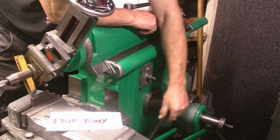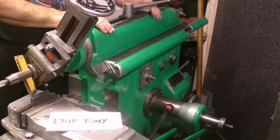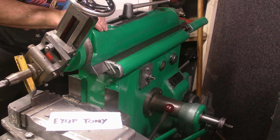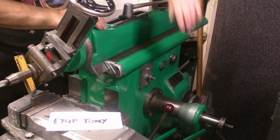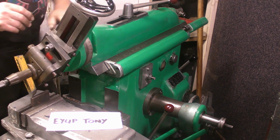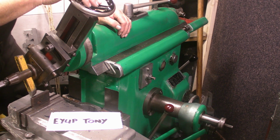Clutch control is this side. This is the screw that adjusts the ram travel, increases and decreases it, with a locking ring on. And then you've got the ratchet mechanism for controlling the table feed one way or the other with this. Manual crank as well on this side. The head is tiltable, it's got 90 degrees either side. And basically the clapper box and the vertical slide. So it's basically like any other Shaper.